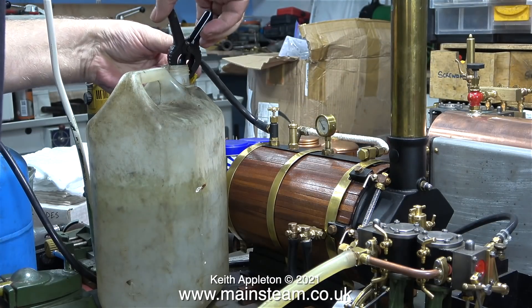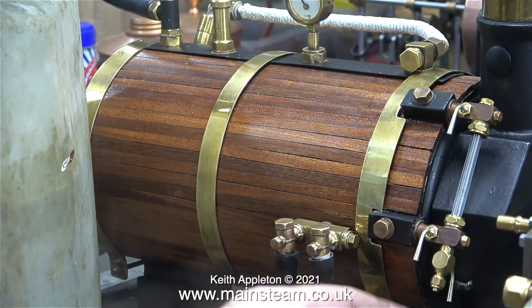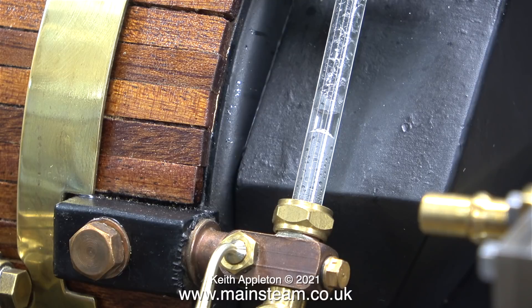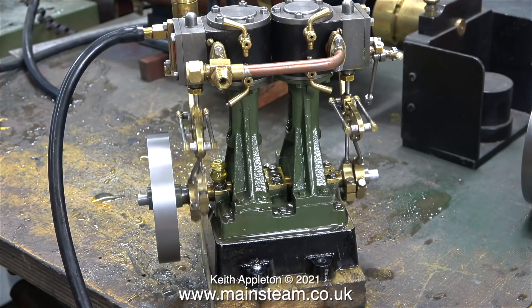This is an ideal opportunity to show how I refill the boiler without using the funnel. The steam outlet pipe is now in the bottle of water. The steam in the boiler has displaced the air, and once the pressure and temperature drop, the steam condenses and creates a vacuum inside the boiler. You can see activity in the water gauge — the vacuum is drawing water from the water bottle into the boiler. Eventually the boiler would become completely full. After a while I open the water gauge blow-down valve to destroy the vacuum, and now the boiler is about three-quarters full, ready for the next run.